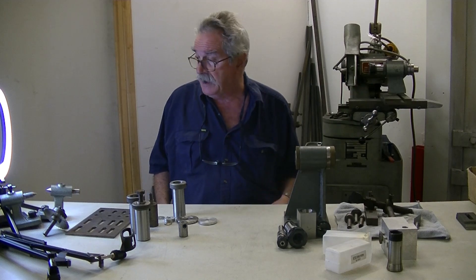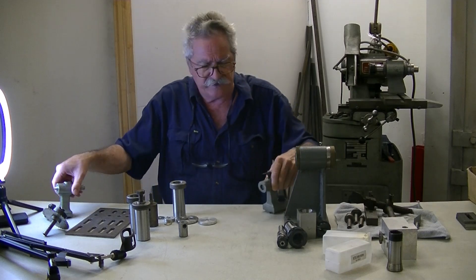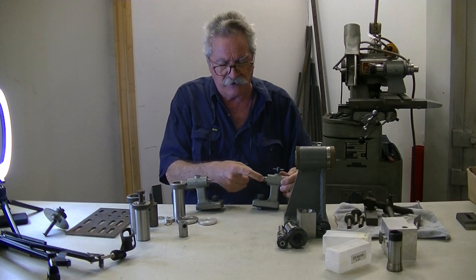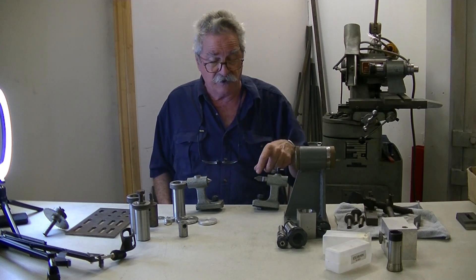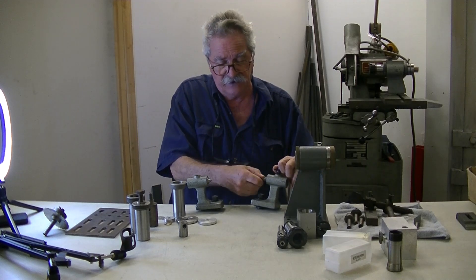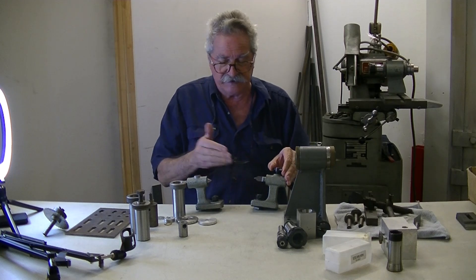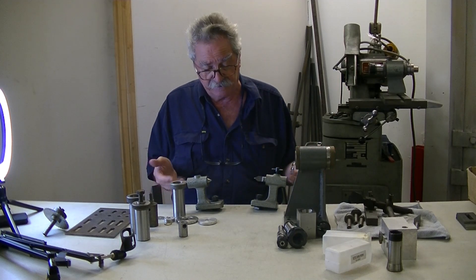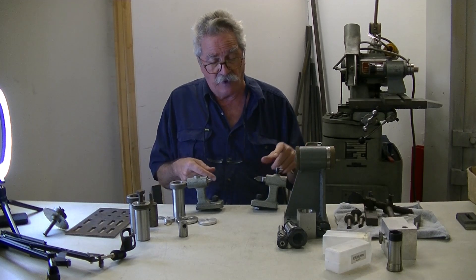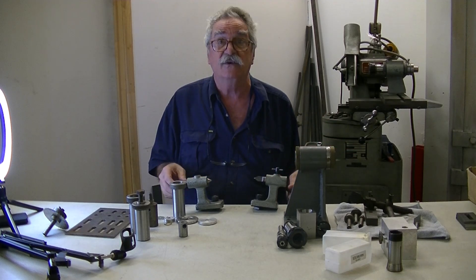Okay, first thing. Not used very often — a pair of centers, and one that's machined away or ground away. That is really good for grinding taps or any cutter where you come over the top of the cutter. You can rotate that so you can escape from the top or rotate it around there and escape out of the side. Not very difficult to make. You can fabricate all of these and then bore them in the middle, and that way your bore will be parallel to the base, so accuracy is something you don't really have to worry about.